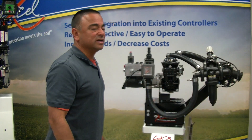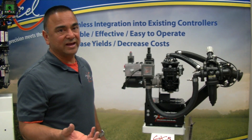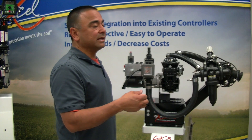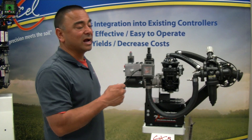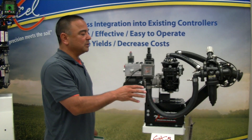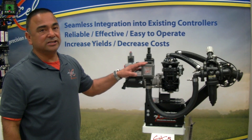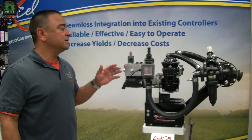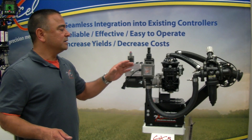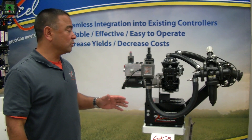We also have our air valve. When there's pressure lock or vapor lock, we can release the pressure. It's very rare that these hydraulic pumps create any kind of vapor lock, but we've set it there just in case, or if you're priming it. These are very good primers, so the valve is there but rarely ever used. We also have it set up with our AgXL mag meter, which accommodates low and high ranges. When doing swath control and shutting off specific swaths, the flow meter can compensate for those low rates.